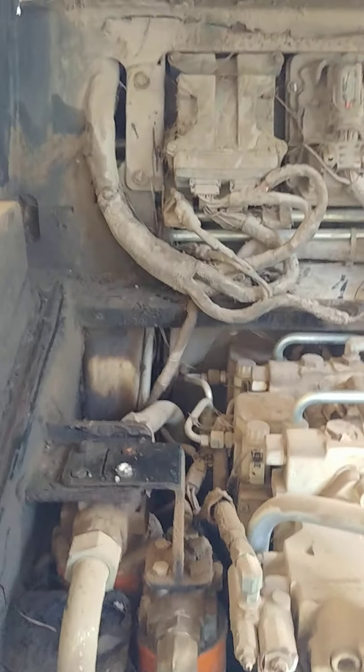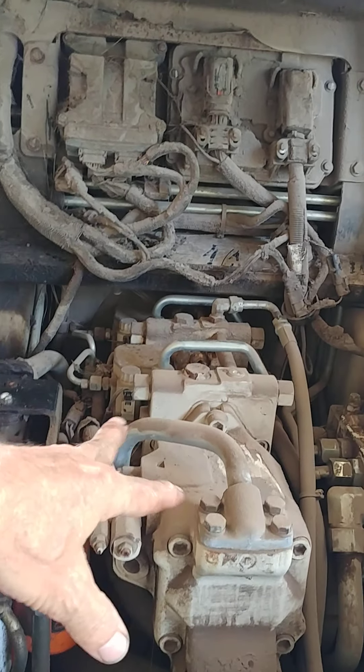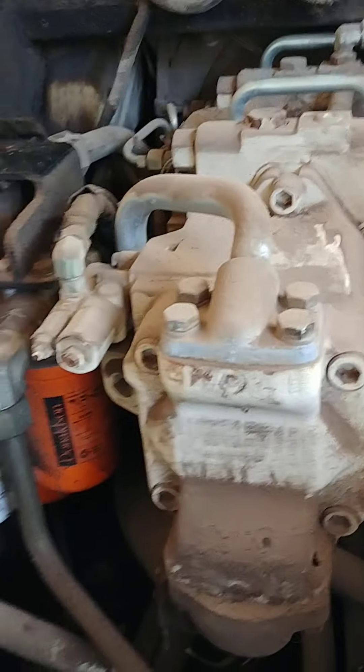You have to take off all your electrical components and all your lines. You can see how dirty this engine compartment gets — this is actually your hydraulic pumps, two different pumps in here. It sucks debris up in there while you work and it's dangerous because it can cause a fire, so you always have to clean this out. It's hard work but I have to get in here and unhook all the hoses.